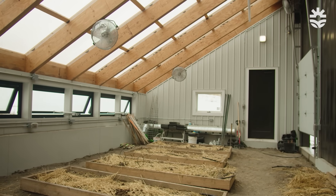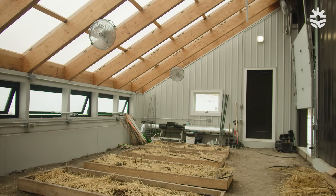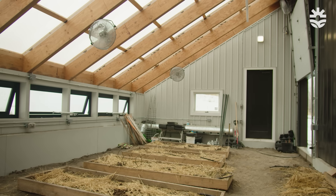The subterranean heating and cooling system is completely automated — when it gets too hot in here the system turns on to store heat and cool the greenhouse, and when it gets too cold the fan turns back on to inject heat back in. It has two set points to moderate the temperature within the greenhouse. In addition, we have an automated garage door: if it gets really hot the door opens, if it gets too cold it closes, and it's also programmed to automatically close at night for security reasons.